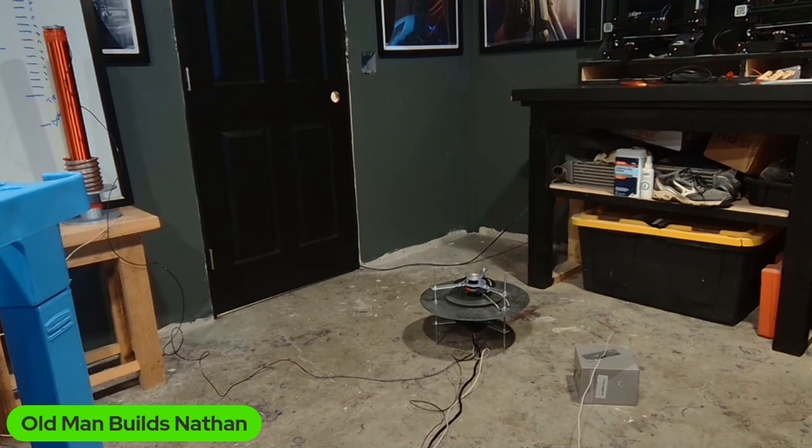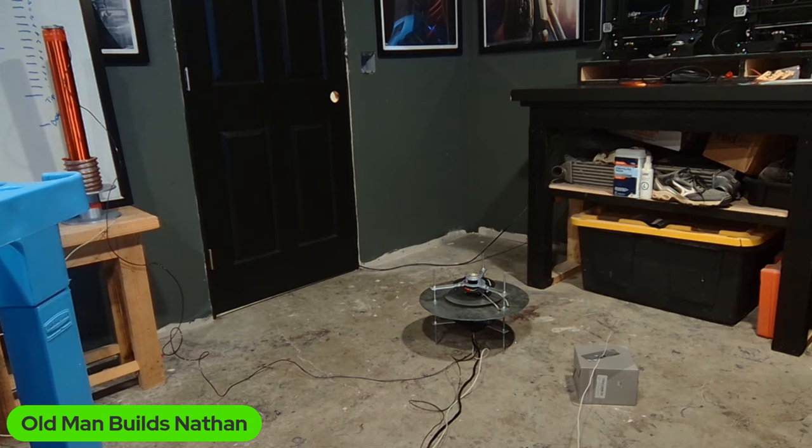All right, guys, I just put it up to my drive. It'll be ready in a few minutes. When we get finished with the testing, I'll show it. So now we have our Tesla coil up a bit. I'm going to check it one more time. I just need to see the heat on it. MOSFETs right now at 120 degrees. The clip itself is at 89 degrees. Guys, we're hitting resonance there. We're good.